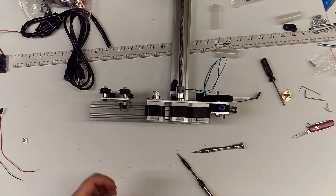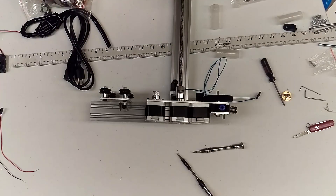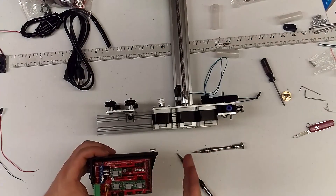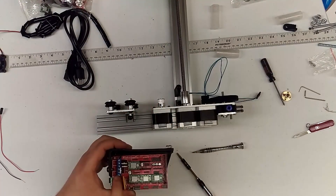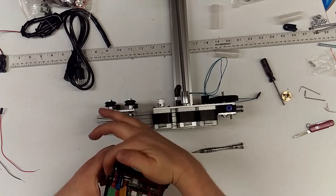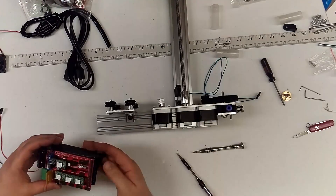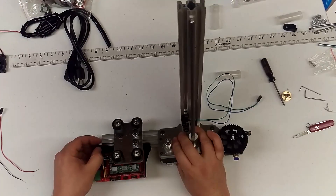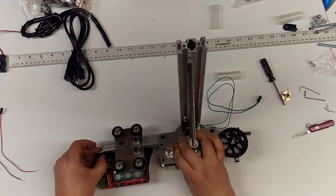The wiring seemed to be the least descriptive area of the user manual, and it's a little complex. But if you know where everything goes on the board — LCD screen, limit switches going X, Y, Z negative/positive, thermistors T0/T1/T2, X/Y/Z motors, E motor, hot end, fan, heated bed, and your 12-volt terminal supply — it's manageable. You can look up a RAMPS wiring diagram online and find a ton of information. Once you do it once or twice, it becomes easy.